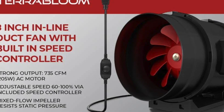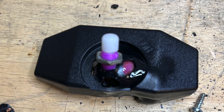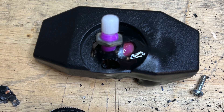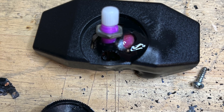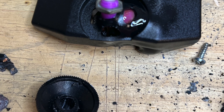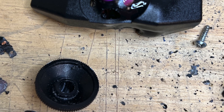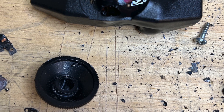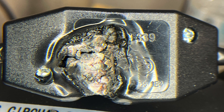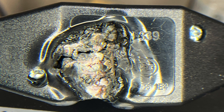So what went wrong? Melting went wrong. I've taken the knob off here, but definitely the package on that significantly deformed. Luckily, it shut down and shorted out before it actually caught on fire. Looking at the knob and the rheostat stem itself, it doesn't appear to be damaged, so we're trying to figure out where the melting first occurred. Looking at the backside, you can see the backside of the circuit board and backside of the rheostat got the hottest as it started charring and melting through.